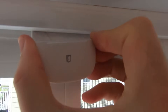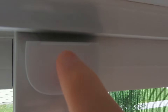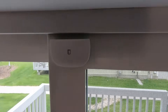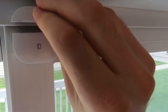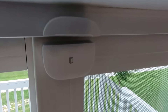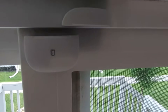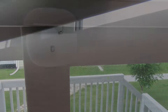Here's my patio door at the back of my home. I'm installing the sensor physically on the frame of the door, then putting the smaller magnet component on top. I'm placing the larger piece on the actual door because it senses vibration, which I can use as a trigger for my security system. Once the door opens, I'll know it's opened. You always have to play with these installations a little bit — that's why I use very little tape for the initial install, so the double-sided tape lets me pull it off and reposition it.